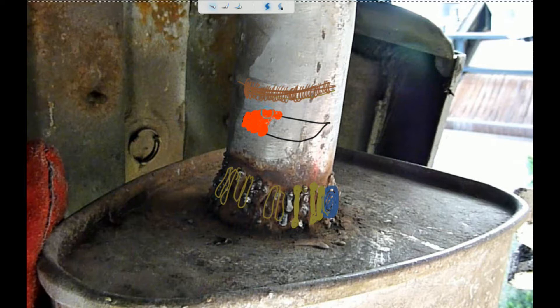So that's a quick overview of how I physically did it, since I couldn't film it without damaging the camera. I was surprised how well it worked using my MIG welder. It was set on low wire speed — the wire comes through the cable via a little pulley and I had it at a really slow speed — and also low voltage. I tried it at high voltage and it was just sparking like mad and wouldn't work. At a low power setting it worked really well.